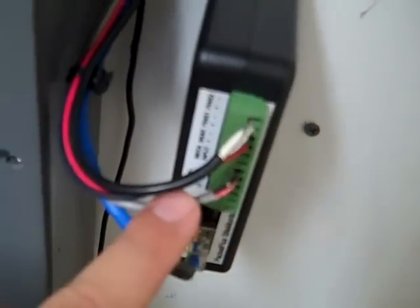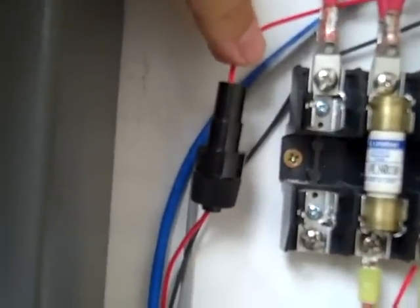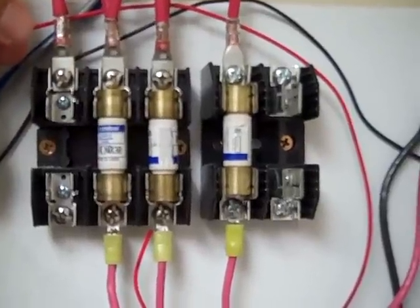Here's the cable going to our generator — you can see it goes right up to the gen set. I've got a five amp fuse in here; this is going straight to our 24 volt bus so I can monitor it, and that also powers the device. This little black cable here goes down to a little transformer and this outlet is not backed up, so if I have a power failure it'll show up on our monitoring system.